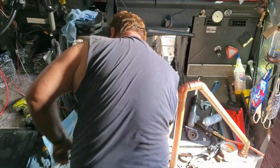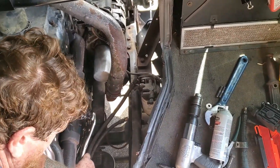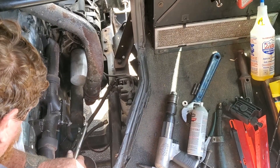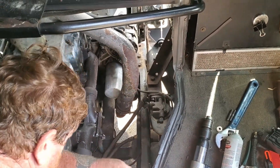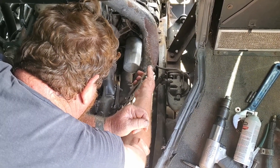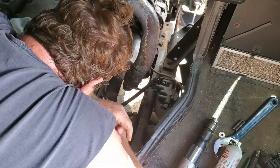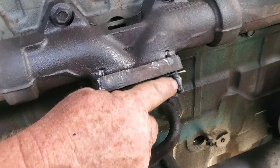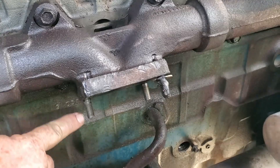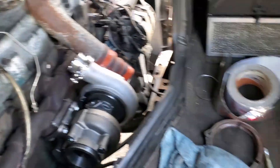How's that bolt clearing going? One out of two. You have to do the sacrificial bolt and washer — the meldonna method. Persistence pays off, huh? Persistence, yes, but patience is a virtue, as an old lady once said. Pretty much the only one I have. All I did was put a washer on it and then put a bead weld there and a bead weld there for more meat for the vice grips to hold on to, because vice grips really don't hold on to threads very well. It's trying to come along.